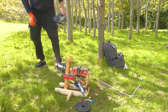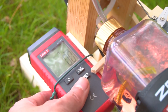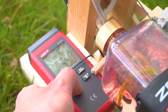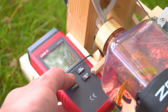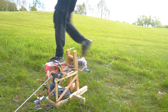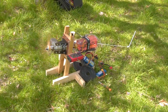If you're wondering what that thing beside the engine is — that's an optical tachometer that is supposed to be reading the RPMs. It uses a laser beam pointing to an aluminum tape I put on the propeller, but it didn't work. I think it's not reading the RPMs because it's affected by daylight. So I guess I have to use a proper magnetic tachometer for this case. I'm not an expert in this kind of engine so I can't give more recommendations, but I'll leave you with images and sound of the break-in process — it went on for more than two hours.